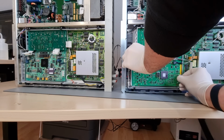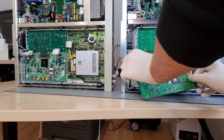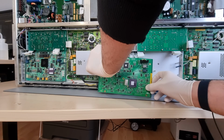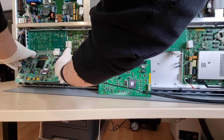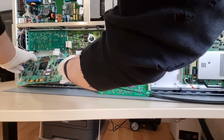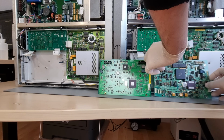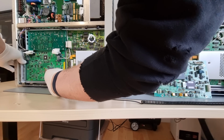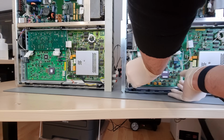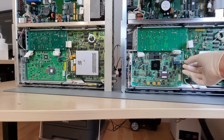I wonder what will happen if we just swap the ADC boards. It's unnecessary and reckless, but once the idea had formed, I knew I couldn't go on before finding out. Hey, if anything goes wrong, at least the A3 board no longer costs as much. Keysight has recently lowered the price from 3K to around 1K. It's still a fair bit of money if you look at it as an ADC. But for the most linear one, and to save a legendary 3458A from the landfill, I would say it's a completely fair price now.